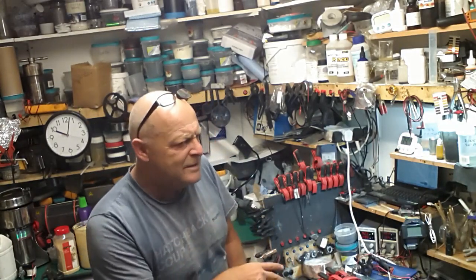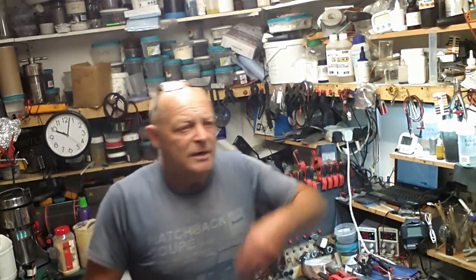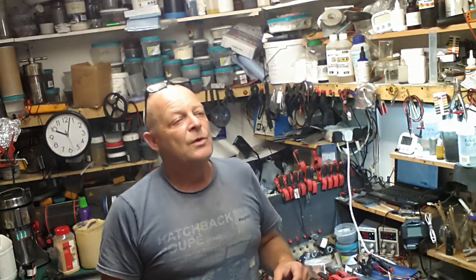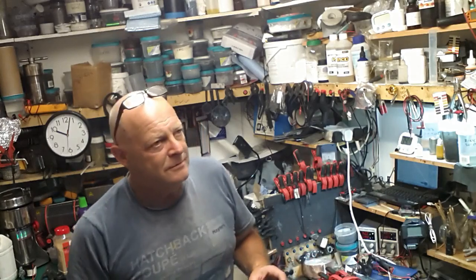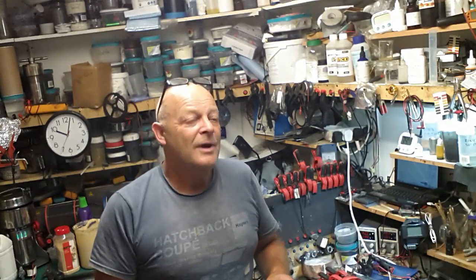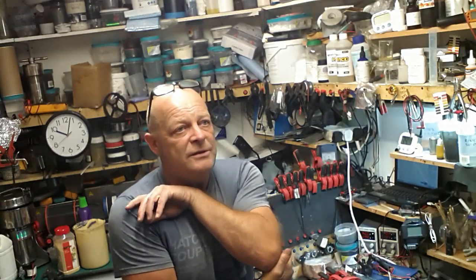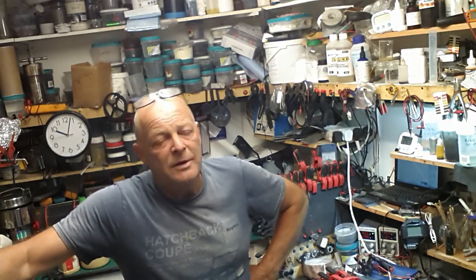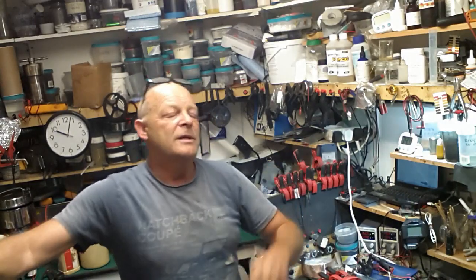Anyway, from yesterday, I'd got a battery running, and I've mentioned that it had an aluminium plate on my anode, negative, as I call it. And it was working fine. It reached 63 milliwatt hours, and there was 0.4 of a gram on the anode and 0.4 of a gram on the cathode, respectively.